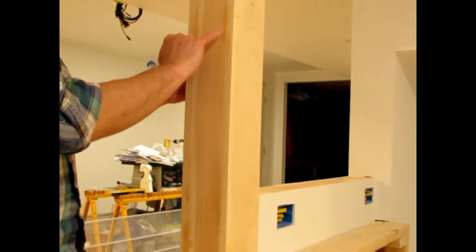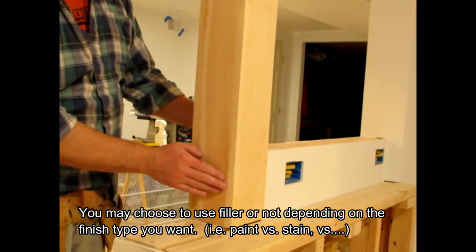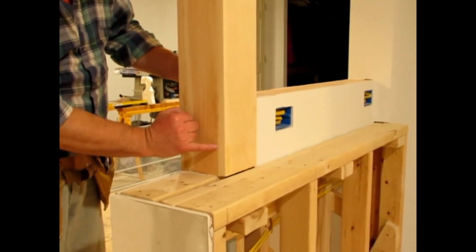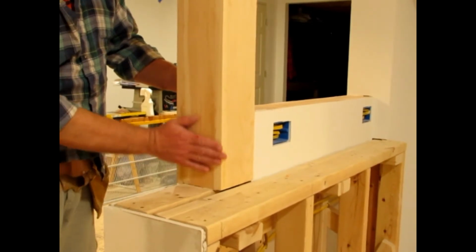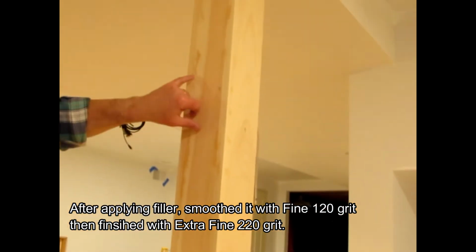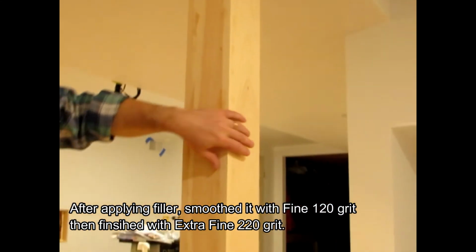to get it right together so you have a nice flush surface. Then I took some wood filler, and you can probably see the coloration here. I took some wood filler to fill in the indentations or the recesses that might still be in the gaps between the joints or anywhere else on the wood, same thing with any knots or imperfections. And then we're going to fine sand that all the way down. What we've got here now is a nice, extremely smooth surface on all sides.